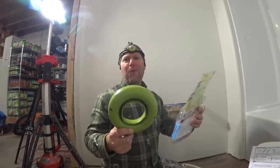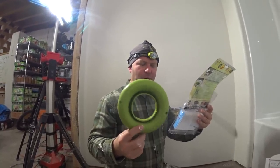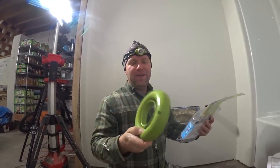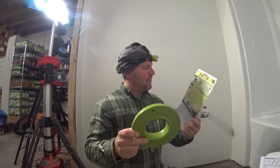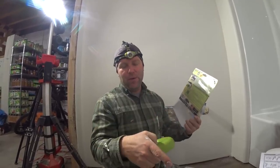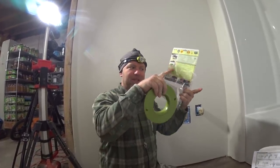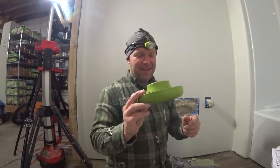It's a waxless wax gasket, and it's pretty versatile. This thing you can do stuff with that I don't think you could do with a wax gasket. Like, you could stack them if you needed to, like if the toilet was really high. And all this does is just seals the trap on the bottom of the toilet. If you've never taken a toilet out, this is what's underneath your toilet that maintains the seal between the toilet and the floor. Usually they use wax, and as you push and wiggle the toilet down, the wax kind of deforms a little bit and shapes to the toilet or the floor, and creates this gooey, disgusting, amazing seal. Anyway, let's give this a shot.